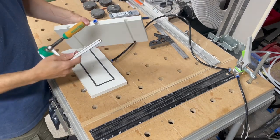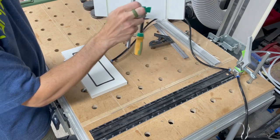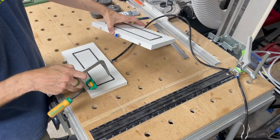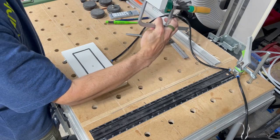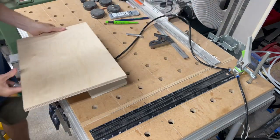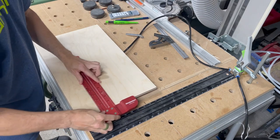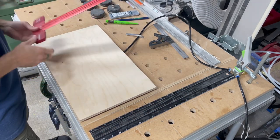So they just fasten to your bench using micro jig dovetail clamps. There's two routes in here, and they clamp to your bench. You can do it in any orientation, wherever you want. You can put them vertically if you want. If you want to work on your piece on its side, you can do that. I really like how when it's running, you have no clamps in the way. You can go all around, mark all around without any clamps moving.